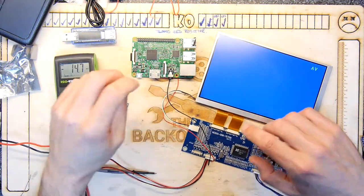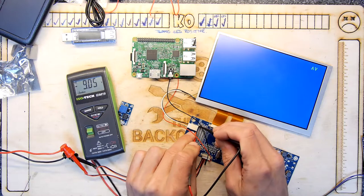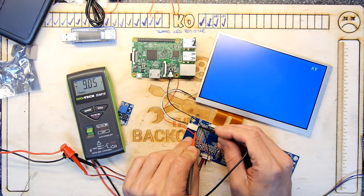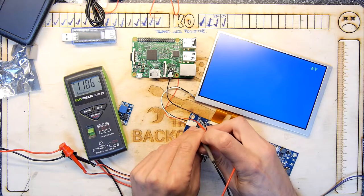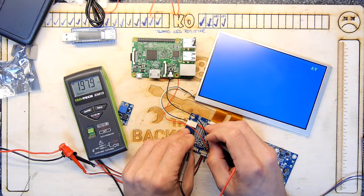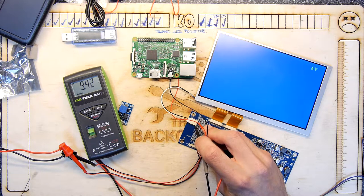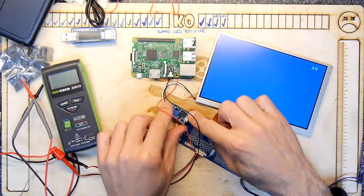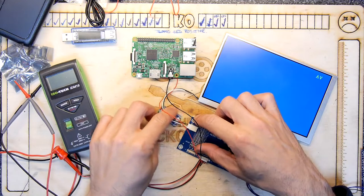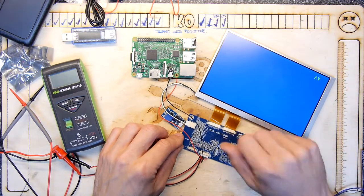So I don't know where I'm going with this — I have to decide my plan of attack here. There is something quite interesting to discover though: the cold cathode driver to the screen is at minus — it's at 9 volts basically. I'll show you the difference if I get the probes on. It's at 9 volts, and if we turn the power supply up to 12 volts, you can see it's only moving a fraction of a volt. So maybe it makes more sense to put our booster just in line with the actual panel LED driver for the white LEDs, and that way we're just boosting the bit that needed boosting, assuming the rest is low voltage and happy enough as it is.